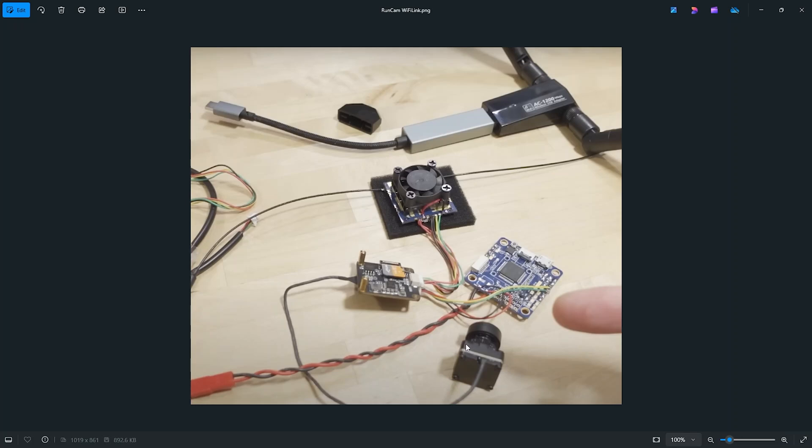Again, we're using the Wi-Fi hardware here so you can see things on your smartphone — security cameras, etc. The camera board here has the SOC, which does all the video processing. It takes the video from the camera sensor board, which is actually what's collecting the video image, sending it via cable to the camera board. Then the SOC does the video processing and turns it into, in our case for FPV, an H.264 or H.265 video stream. That then gets sent via wires to the transmitter, and gets transmitted over to the receiver.